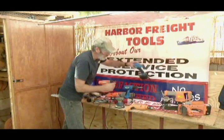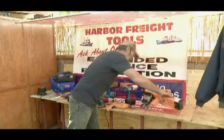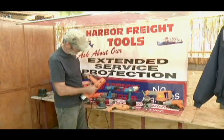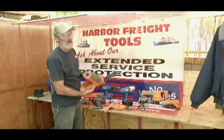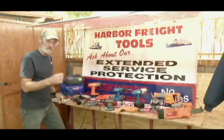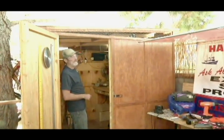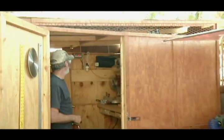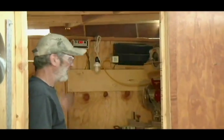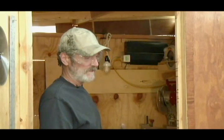There is a multitude of battery tools that you can run — even my favorite: the chainsaw. And that's it. The compressor just kicked off. It was at 12.3, and as soon as it kicked off, it went back up to 12.6, now up to 12.7. So even though we were running all these different things — which you're not going to run all at the same time, mind you — you might run one or the other. But as you saw, I only had two hands.